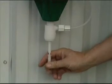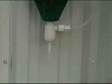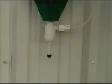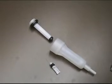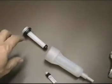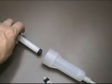The chemical pump module is a replaceable cartridge to make it easy to replace when the harsh chemicals wear it out. The pump quick clip piston is made to be easily removed and replaced by snapping onto the connector stem when the harsh chemicals wear it out. The pump piston runs in a separate sleeve cylinder in the cartridge that can be easily replaced when it gets scratched by abrasive chemicals.